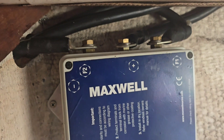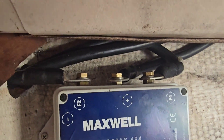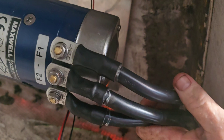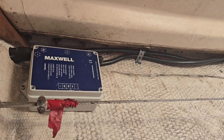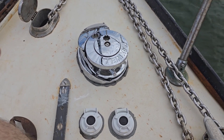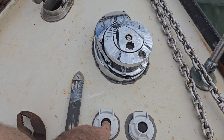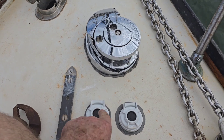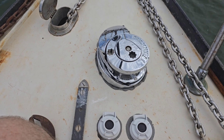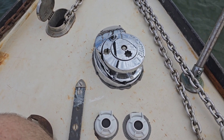The hard part's done — the 2/0 cable is on the solenoid box, goes through the bulkhead into the anchor locker, and to the windlass motor. It's all secure. Now it's control wire time. All the electrical work is done, so let's test. There she goes — that's up, that's down. Our anchor windlass is working.